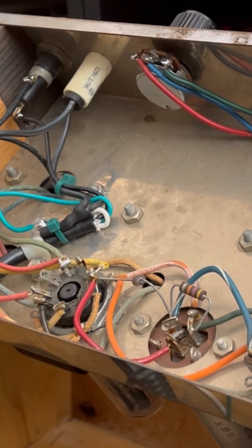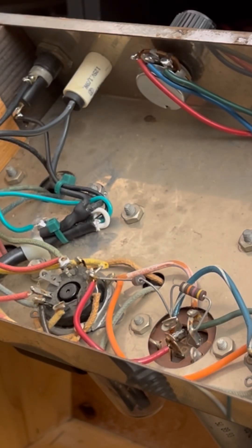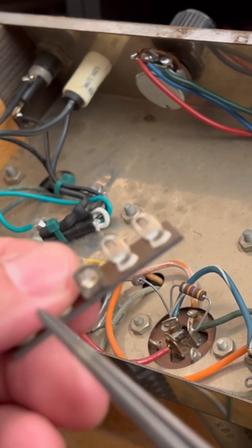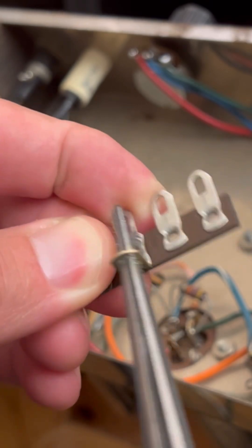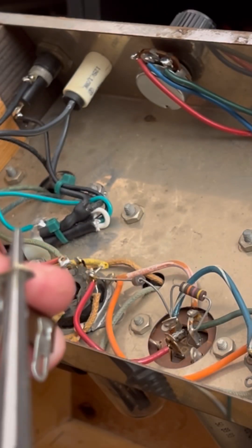These guys as they are now aren't going to make it on top. These are number eight bolts — machine screws. I use a woodworking tool like this to open up this soft metal. You don't want to use a power tool to do that because it's going to twist this bit of metal here and you'll end up injuring yourself and ruining your terminal strip. Just use moderate pressure — if you put too much pressure you're going to bend that bit of metal.